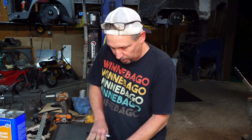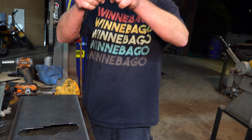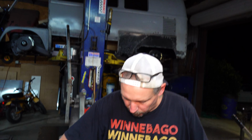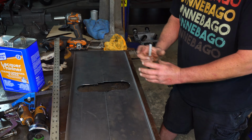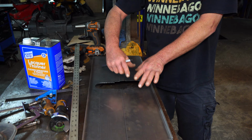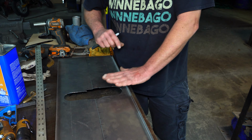And this is the top. Going down, I'll make a band like an oval, kind of like what would go around a fuel cell. Is that what you're thinking, like it clamps the fuel cell and the fuel pump? No, it would be a flange sticking straight down, and maybe a little lip at the bottom outward, so that the inner tube can fit on the cylinder. Then I'll stretch it around that and clamp it going down, and on the top I'll make a flange and make that leather boot, which would come up towards the top. But I'm going to keep it low because I want to be able to see this cylinder. That part will be leather, just the cosmetic part. And that rubber piece down in the bottom will be watertight, and it would actually stretch on there.